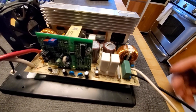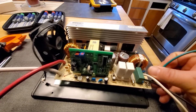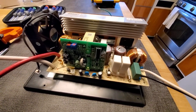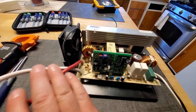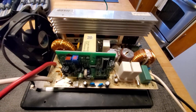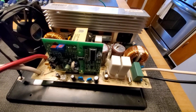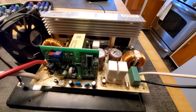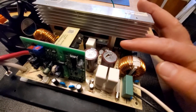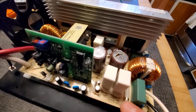Here's the black and white wires. The green I already pulled off because I started to disassemble this, but the green will get screwed in over here — it's a ground to the board. The alternating current, 120 volts, comes in here, is processed through here, and comes out on this side as 12 volts. You can tell by the thickness of the wires it's designed for high current. Since this unit is not designed for 240 volts, what happened is we blew the capacitor here, and luckily blew the fuse, which may have saved the rest of the components.